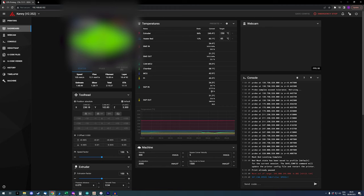We can see the SGP input VOC index climbing really fast — it was in the 60s and now it's over 300. As the fan is running it's pulling dirty air from inside the chamber into the filter and through the SGP40. The output VOC index is actually going down, not up. My guess is that previously, with the fan off, stale air was rising from the chamber into the filter. Now that the fan is running, it's pushing filtered air back into the chamber, so the exhaust air is actually cleaner than before.